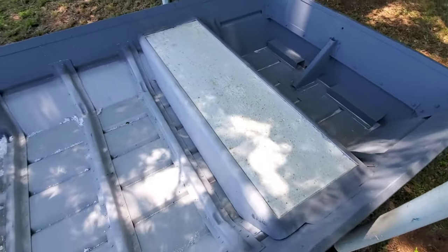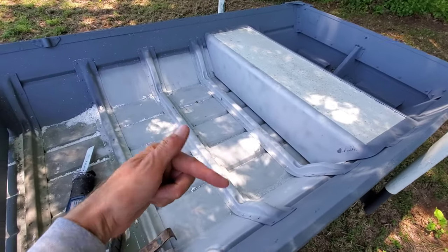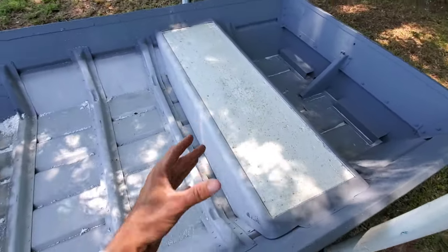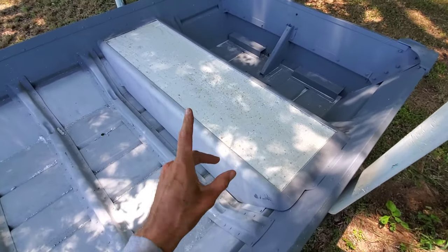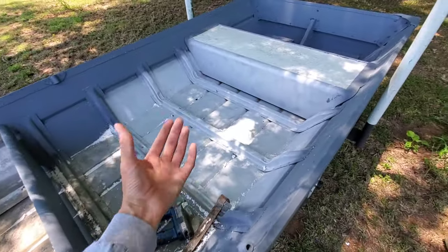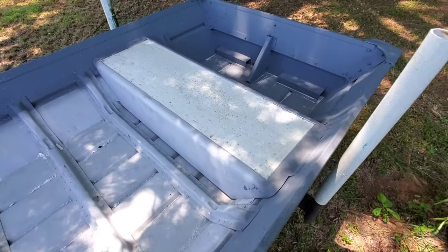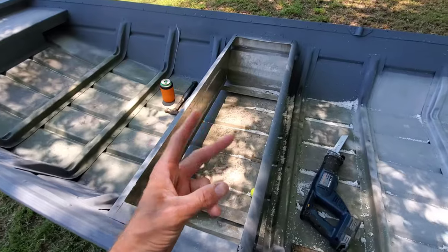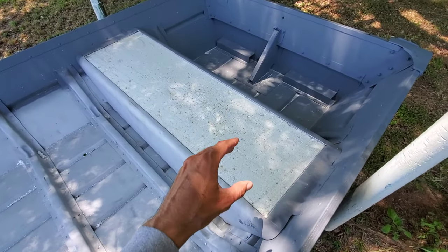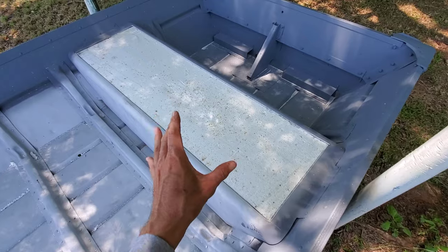Before I show you how I gut this, I'm going to give you the speech on removing foam from your boat at your own risk. There's always that guy in the comments section who preaches about buoyancy and safety and why these foam blocks are put in these benches. These blocks are put here for a reason from the factory - if you were to take on a lot of water, these blocks would help keep your boat afloat longer. Or if you were to flip the boat in the water, these will keep your boat from sinking, or at least help. But with that said, to add function and performance to your boat, there are pros and cons to removing the foam - yes you lose what was put there from the factory, but you gain a live well or a storage hatch.